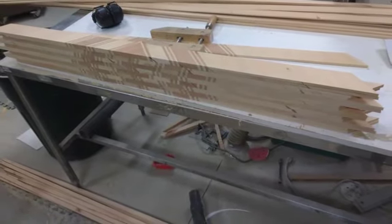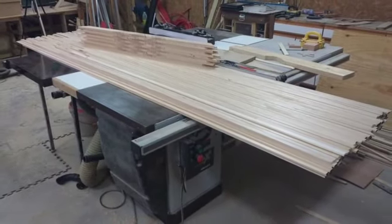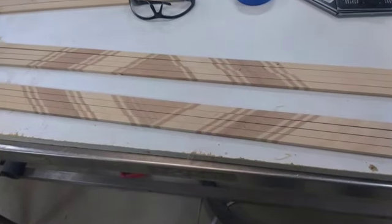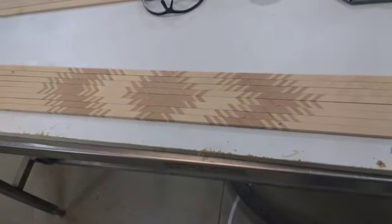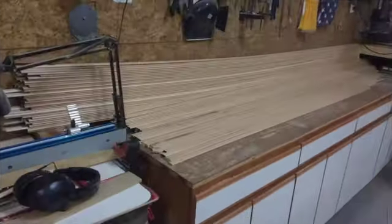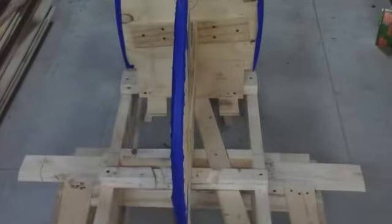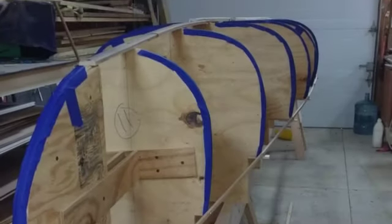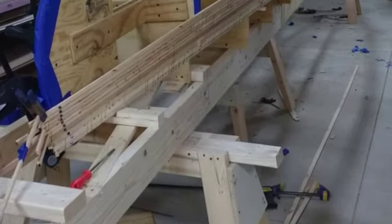After that we had to cut off the center piece of cherry to square it up, which left me with a bunch of strips and a bunch of backer boards. I resawed the decorative piece and put some tape on there to provide support, varying the pattern so I could give it a little support while milling it up and running it through the router. I routed all the edges, and here you can see taking the first couple strips on the canoe.